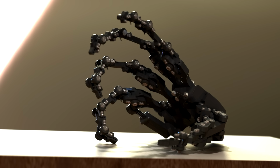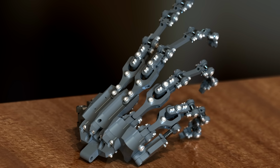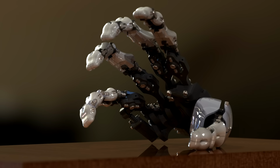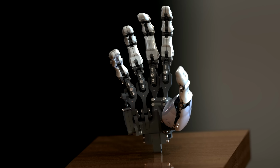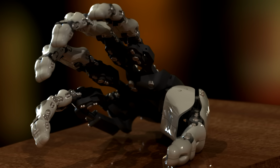The solution would be to have a feedback sensor in every single joint, and then it could be more or less perfectly accurate every time. But obviously that would add a lot of complexity to the assembly. It is something that could be done, it wouldn't be too much trouble. Using the kind of really small potentiometers that are used in the control glove, there's no reason why you couldn't have something like that. And maybe in a future redesign that will be something to think about.